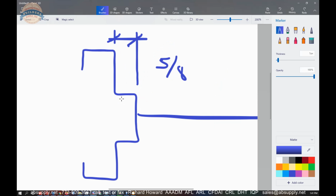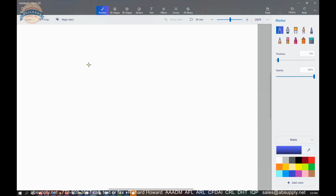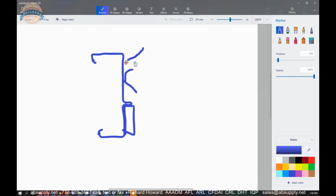However, when you have a blade stop application on your frame, what you really have is this. Well, actually, it's going to look more like that. Okay. However, an aluminum frame is, I'm not an expert with their profiles, but what you'll do is notch the blade stop area, and that strike is going to be ultimately mounted in this area so that there is no offset at all to where the door positions otherwise. I drew that strike backwards earlier, it's really shaped, curved like this. Your strike is going to absolutely make contact with the rabbet.